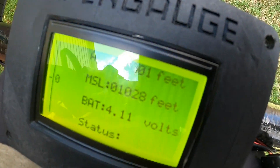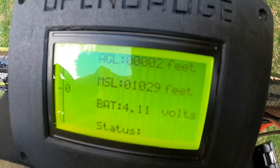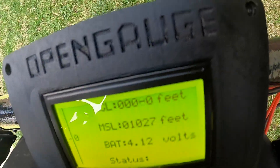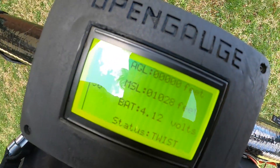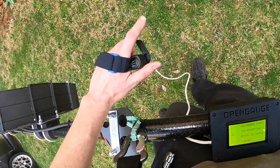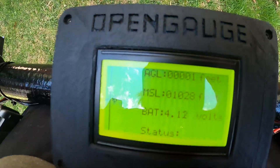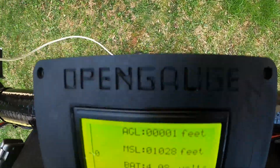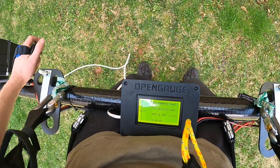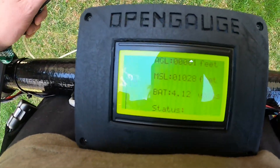The status is down there at the bottom — it'll show low voltage and also show the twist. So here we go twisting. I made it a little more sensitive and made it last longer. Twist — now it's one Mississippi, two Mississippi, three Mississippi, four Mississippi until you can really go again. So if you're flying along and you get a single motor, speed controller, or propeller failure and you start getting a riser twist, it'll stop.